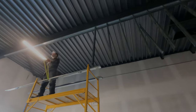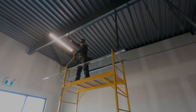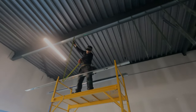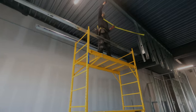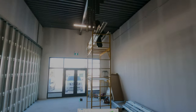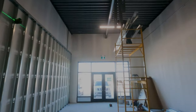Most ceilings and roofs are sloped, so all of these studs are different sizes. On this one it was about 3/8ths difference every stud. Unfortunately, not all the time can you get away with cutting them the same size — it's very, very rare in a bulkhead. Unless you're doing it on the main floor of a two-story building — that's the only time you get a level floor above you. If it's a Q-deck or the roof above you, guarantee you it's sloped. So check all of your studs.